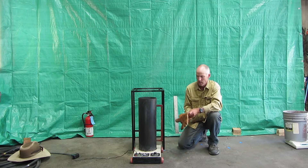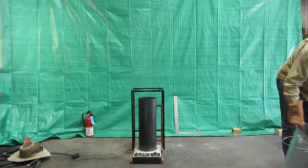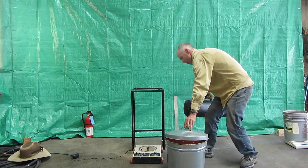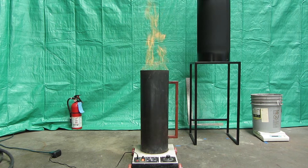Here you can see the unit is finished running. We take and carefully pour the charcoal into an airtight metal container so that combustion comes to a stop. We also have caps for the burn chambers, allowing the hot chamber to be placed outside to cool before emptying. With multiple burn chambers, you can continually run the T-LUD stove as needed.